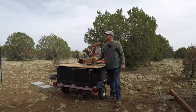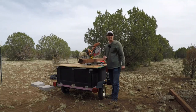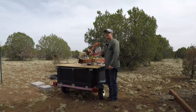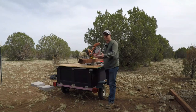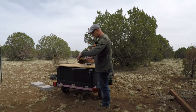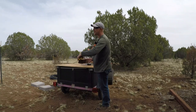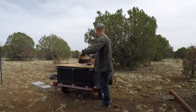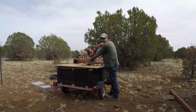This is an eight-foot four-by-four, but it's been sitting out in the sun for a while. You can see the twisting in this four-by-four - it's dried out and changed its shape a little, and has shrunk slightly. So you're going to want to make sure you're measuring half of whatever the actual length of the board is. It's supposed to be eight feet long, but after drying out it's now one-eighth inch shy of eight feet. Just make sure you cut the board exactly in the middle.